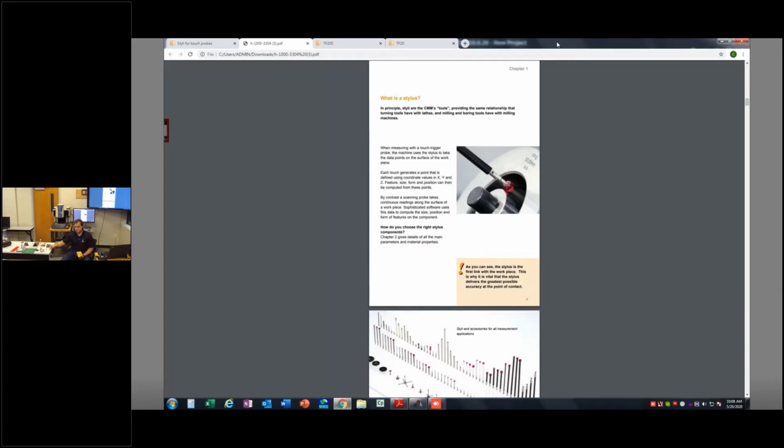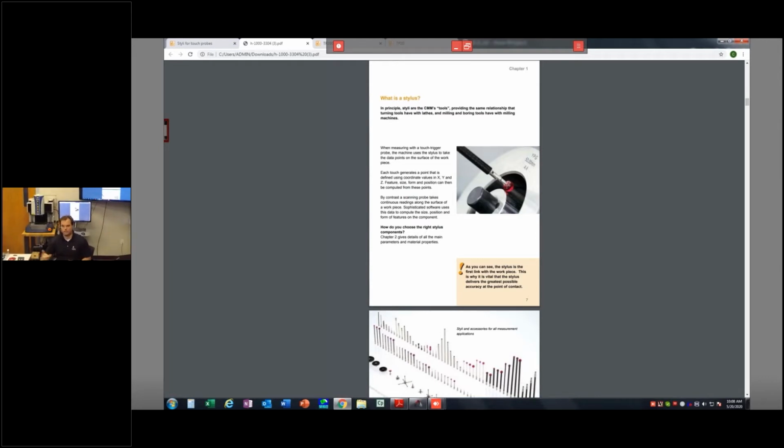So I could bring in my touch probe here. And if you can see that, I could come in and pop a bunch of points on there. And now I've got a cylinder. And I know a little bit more about this feature than I did before, okay? So I'll jump back and forth and look at some of the different considerations there.